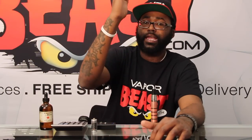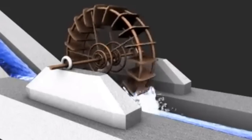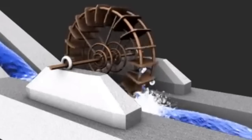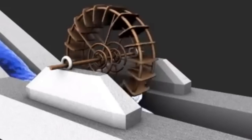Imagine we have a water basin with a floodgate that goes up and down, and then we have a water wheel that the water in the basin is pouring onto. That water flowing onto the water wheel — think of that as your voltage, the electric current flowing through. The floodgate going up and down — think of that as your resistance. The water wheel spinning — think of that as your amperage. As we raise the floodgate, just like we raise our resistance, the water wheel won't be spinning as fast — same thing with our coil, it won't be heating up as fast.